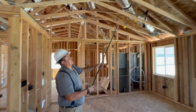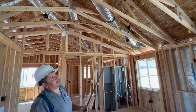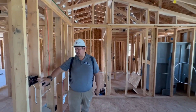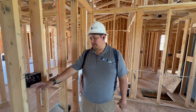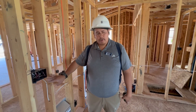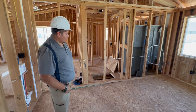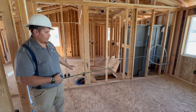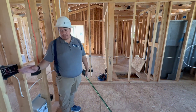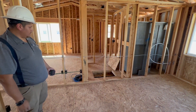Here in the middle of the living room, this one is pre-wired for a ceiling fan, which will be controlled right here. So you've got three — one will be for your fan speed, the other one will be for your lights, and the third one will be for your half-hots outlets. Two of them are going to be half-hots, which means you're going to be able to control the outlets through a switch — it'll be the upper outlet.